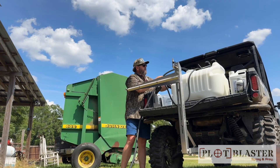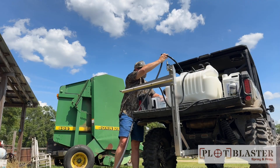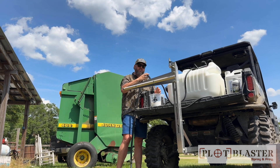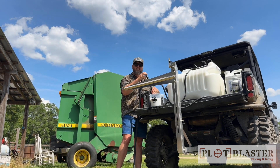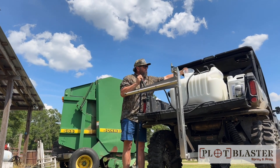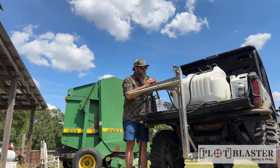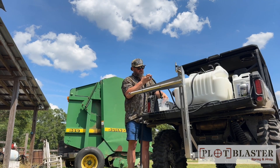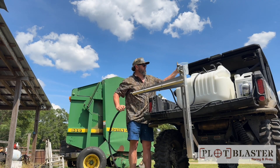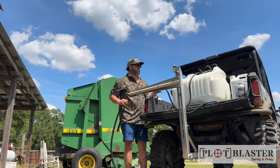It's harder to clean and you may end up with some debris that could cause issues with your pickup screen in your tank. If you're ever trying to do any of this and feel like you're not getting the flow you need — I've had a couple of customers reach out about that — check that pickup screen. All these tanks are going to have either a hose going down in the bottom with a little filter system, or a hose screwed into the bottom with a screen. Keep that cleaned out for maximum flow. That's another great reason to use Solumax 5 — it serves as a tank cleaner as your product's going through, and keeps that system like you want it to be.